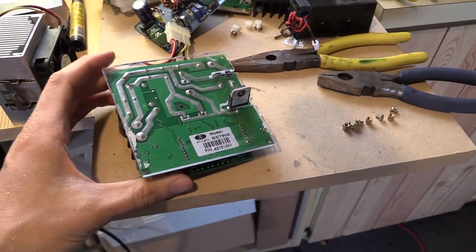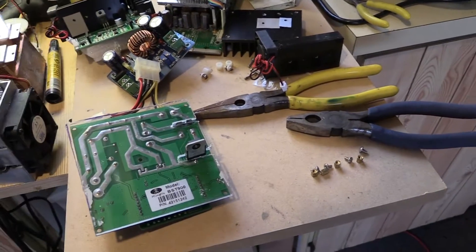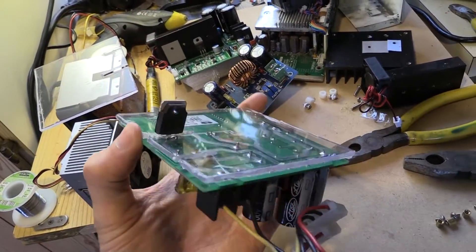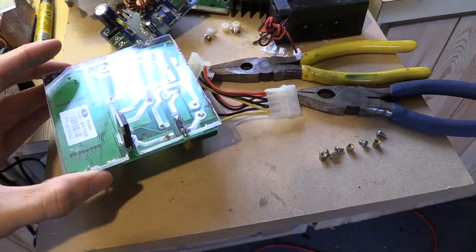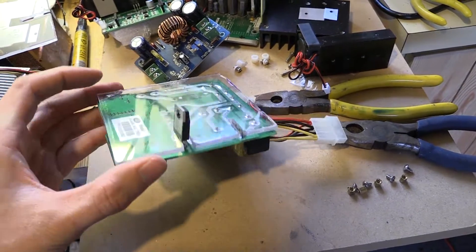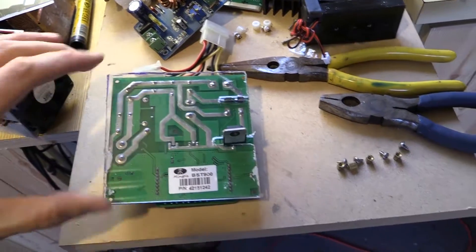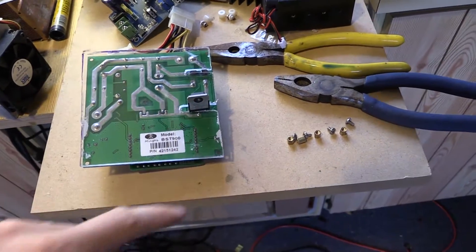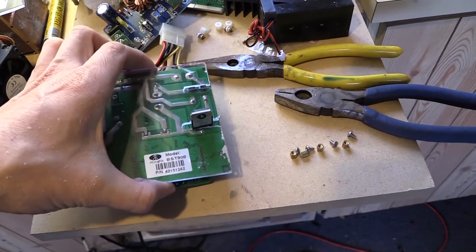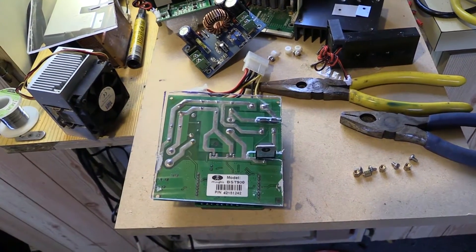So I've put my piece of perspex on there. I pretty much cut two lips out of it — one to be able to slide over the fuse part that comes up way too high. Rather than cutting or grinding it off, I thought I'd just cut a slit in it so that it sits in there quite nicely and just slots under the bottom lip of the MOSFET there. It's in there quite nicely. It's not cut exactly to size, but it's pretty damn close. It's a bit crusty around the edges, but it doesn't matter because you're never going to see it — it's only there to protect the circuit board and to stop any shorts against the heat sink, and obviously to hold the heat sink in place.